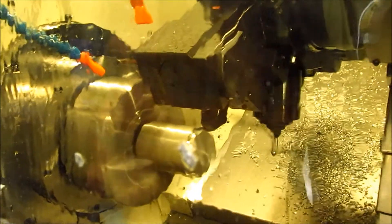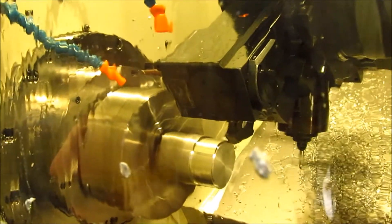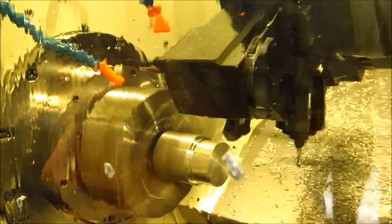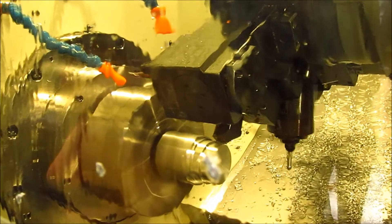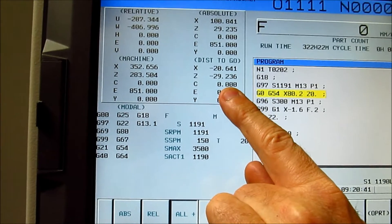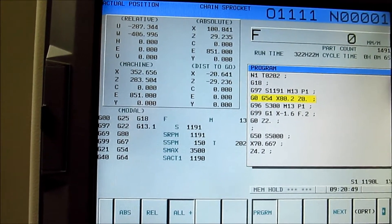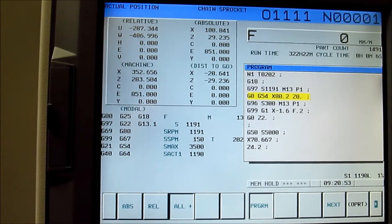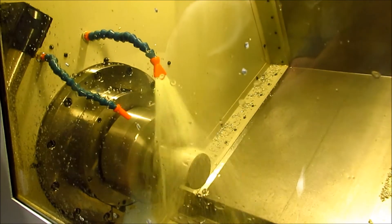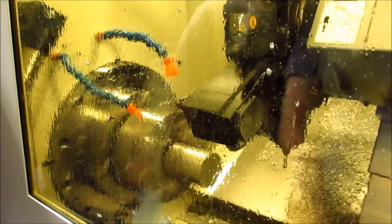This is the CAM output. Question: is it possible to crash the other tools into the chuck when you're doing a legitimate operation with one of the other ones? Is it possible? You can possibly crash anything. You can set up a boundary around the machine called a chuck barrier. In industry where stuff is really important, I've had Z minus 5,000 mil — in serious trouble. You'd be surprised how many times you tell students and they don't catch it. I had an incident yesterday — just didn't see it at all, 40 millimetres off the job, goodbye tool. Worst case someone gets injured, and it's not good when you crash a thousand-dollar tool. So I'm just going to come in slightly for my first cut — let me just pause it there. This is the most important part...